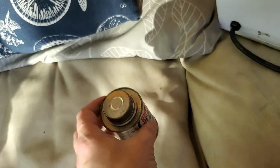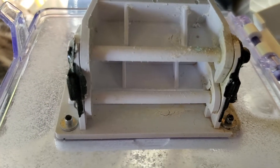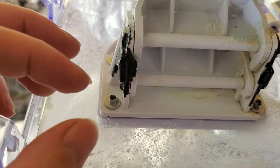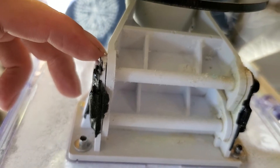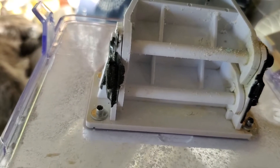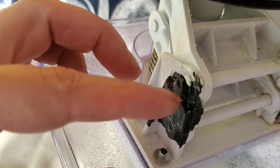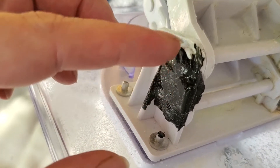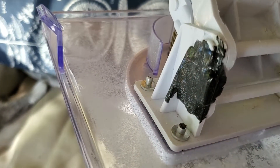This is like $4 at Home Depot. Now it's very important that none of this black gunk — this hard plastic once set — gets through and into this gap here, because this is the arm that the whole thing rotates on. If that gets frozen in place, you've just ruined your JFJ. So what you want to do is put on just a tiny little bit to sort of seal around these parts here. Remember, this part doesn't actually have to rotate — it's allowed to be completely static. But you don't want any of this black cement to seep in behind here, go through, and then get to here. So a very, very light touch on your first application to seal it, and then you can go heavy.